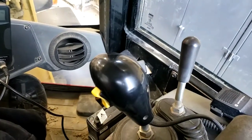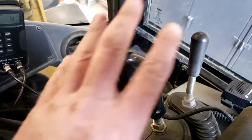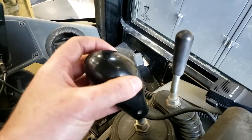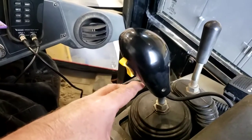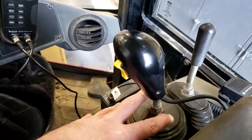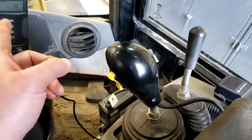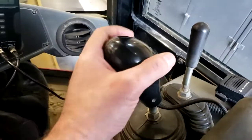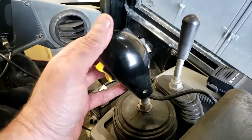So we'll have a check of our pilot pressure. We're going to go down and move the one gauge from the upstream side of the pressure-reducing valve when we're feeding the pilot to the two pilot controls in the cab here — one for lift and tilt. This machine has an optional joystick, a two-axis control for lift and tilt, and then a single-axis pilot control for auxiliary. The pilot is fed here not from a pilot pump, but from a pressure-reducing valve downstream of steering. So steering pressure supplying that pressure-reducing valve could be 600, then it could be 3,000, then it could be 600 — a big pressure range. That pressure-reducing valve is going to be busy supplying pilot pressure with its specified amount. So we'll go down and move that gauge.